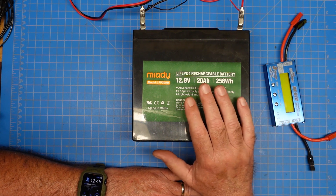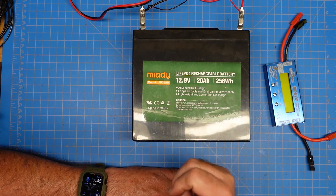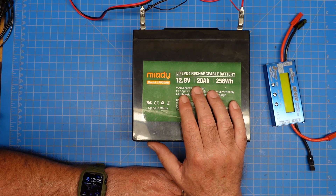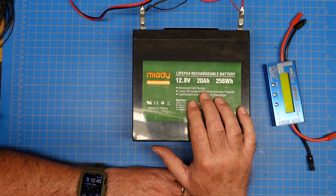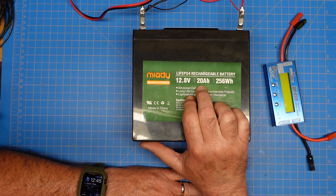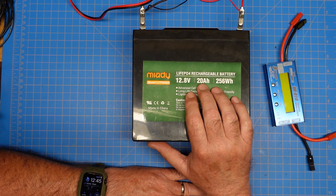When you go out and you're talking on the radio — either sideband phone or doing FT8 — you're obviously drawing current at that point. If your radio draws 10 amps every time you key up, and you held the mic down the entire time doing one continuous tone drawing your full 10 amps, this battery would last two hours.